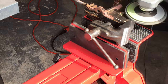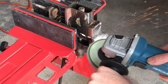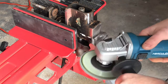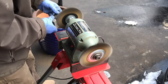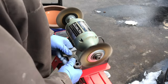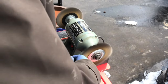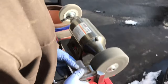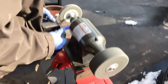Another thing to keep in mind: always try to keep the vise together as you're sanding, so that way everything will just line up perfect. Made that mistake early on — not this time. After that, I just cleaned it up on a nice soft wire wheel, and that helped getting all those nooks and crannies and knocking all that excess paint off. I did that at the edge of my garage so I just blow everything outside. You can't hear it because I got it muted, but it sounds like my bearings are starting to go in that Delta. I'll have to take a close look at that. And then any of the surfaces that needed a little bit more polishing finished up on the fiber wheel.